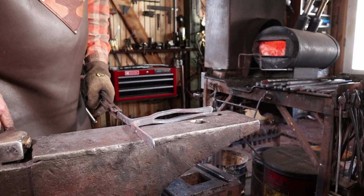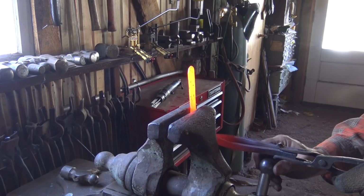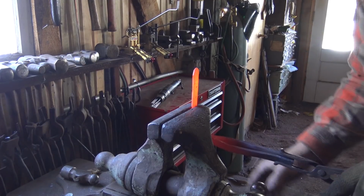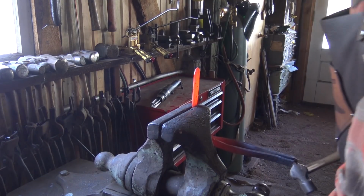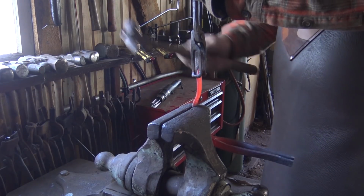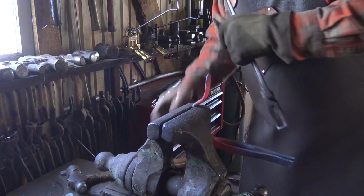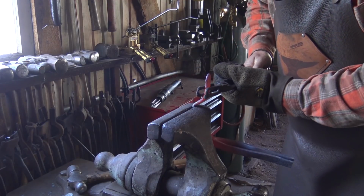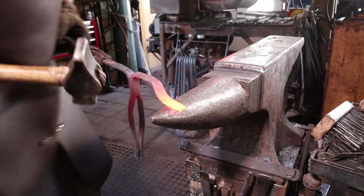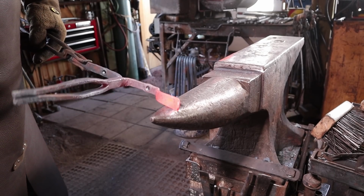Hopefully in a minute this is going to make more sense to you. I'm going to put this in the vise so that my hole is clamped down there with enough room for the head of the bolt. Guarantee it stays on a flat portion of the hook. And we've done this with a lot of hooks. Bring that forward like that. And this will be the top hook. Kick that end out a little bit, and that's really all I need to do to that.